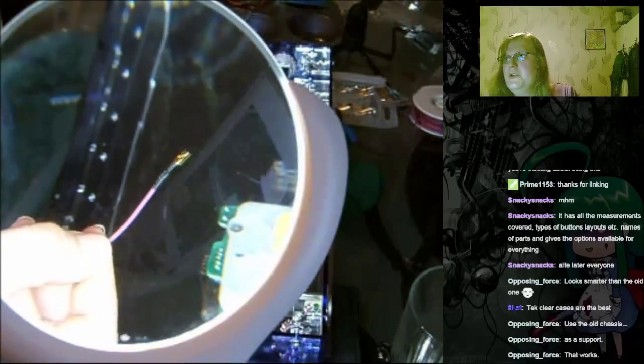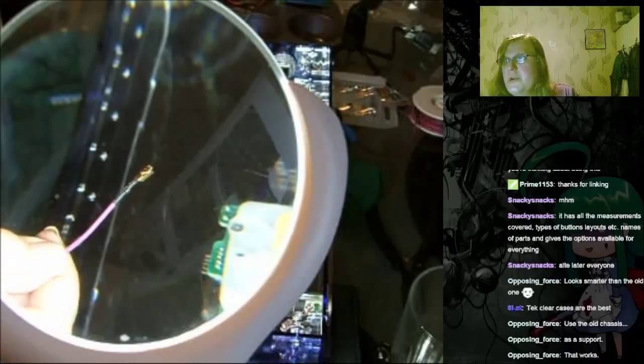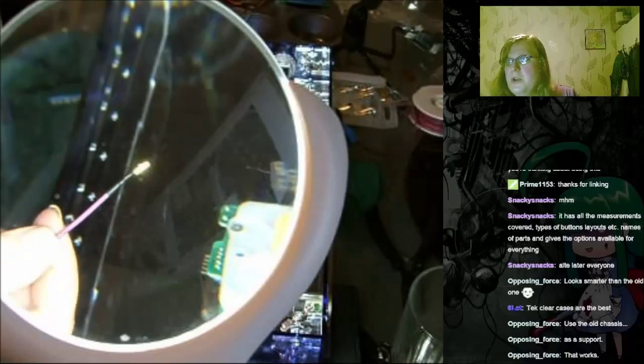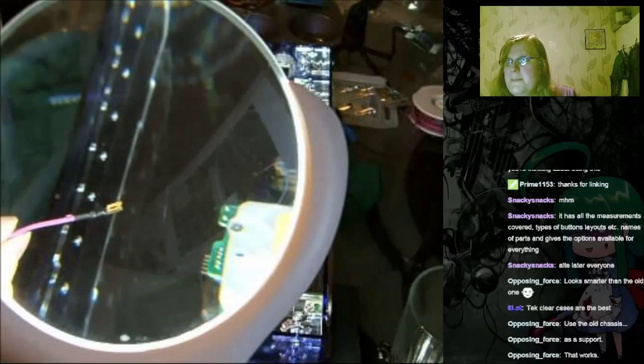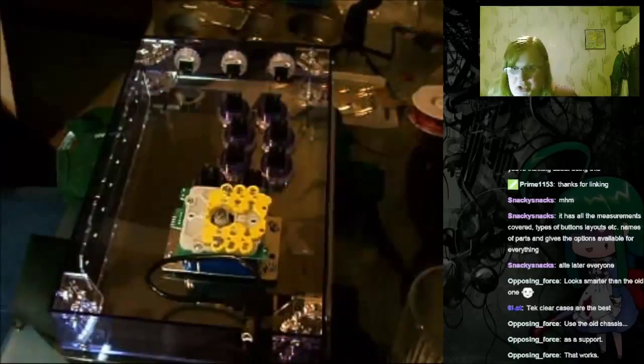Basically each individual crimp connector goes on there and you squeeze it on, and I'll show how to do that in a short while. And what I've done with this is I've put some heat shrink sleeving over the top just to make it nice and tidy and make it less likely that they're going to short out afterwards.